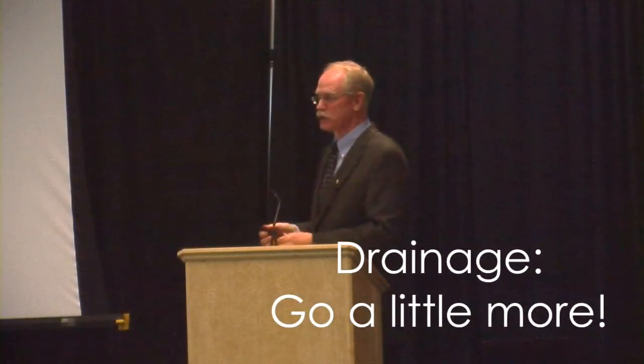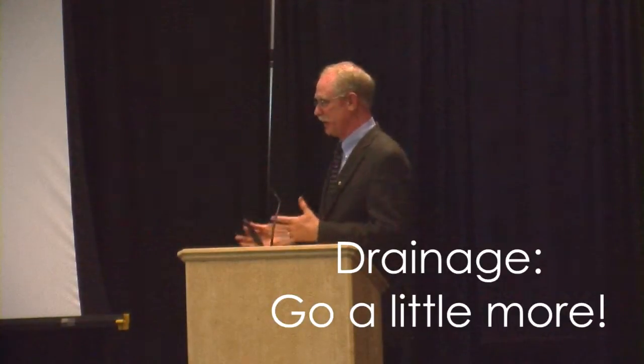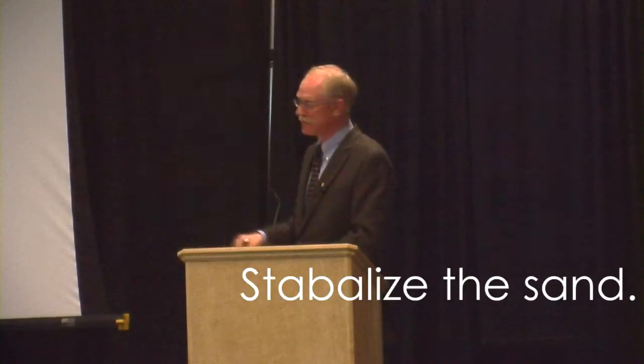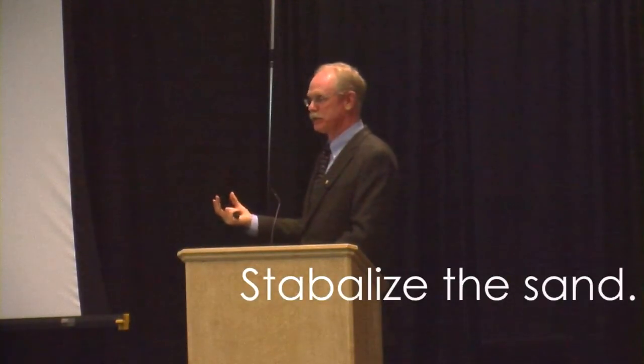So, lessons learned. In drainage, go a little more. You're going to save money over time. Stabilize the sand. Get the floors flat and choose the proper sand. The sands that people are selling nowadays are really good. They're really stable. Everybody's concerned about penetrometer readings and keeping things so that the ball sits nicely on the surface. So the sand choices are really good. And liners, use them with good choices, with intelligent thinking through the issues at hand.